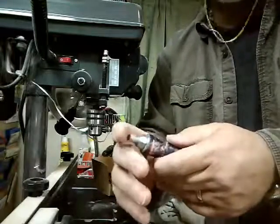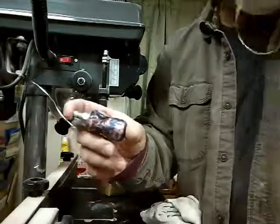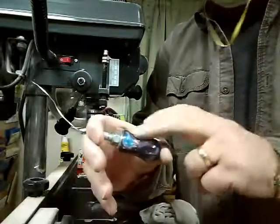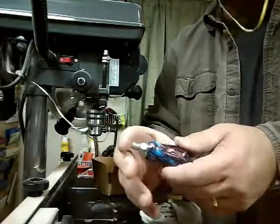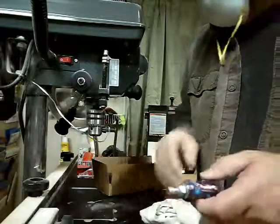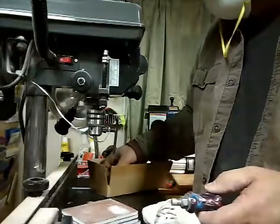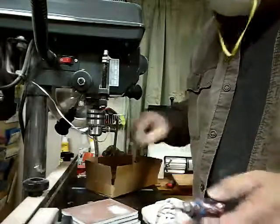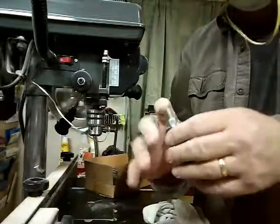Whenever you start sanding it with sandpaper, you start off with 80 grit. You get a lot of deep sanding marks, so you have to continue to sand it as much as possible to get it smooth, and go through the steps of your sandpaper. You can go up to 400 grit, 600 grit. You can wet sand it, it'll be great too, and then go through your micro sand, which is these. And I have a smaller set too as well, a more tedious set. You can get these on Amazon. But this is a start.